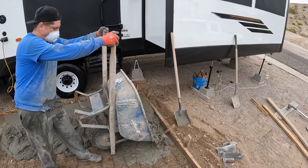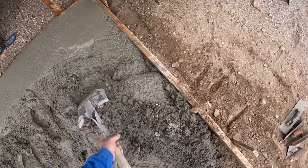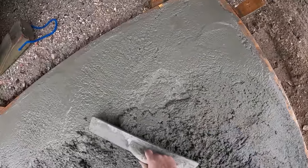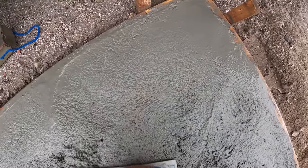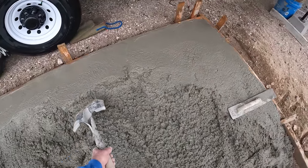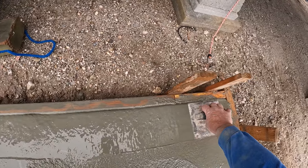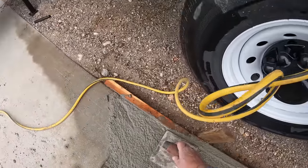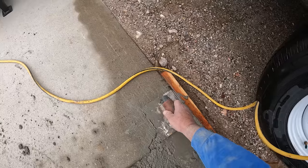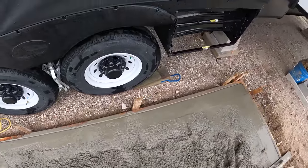You can see that mess the chef made on himself — that's why I recommended the apron. He did use it and it worked out great. Right there around that stake, because my lumber was so twisted, I had to put an inside kicker to hold the form straight. I packed some concrete in behind that stake so that when I pull it out — once the concrete is hard enough to hold the wood in place — I'll pull the stake out and pack the hole. Now's a good time to edge it without having to shimmy along the trailer later.